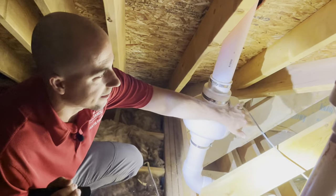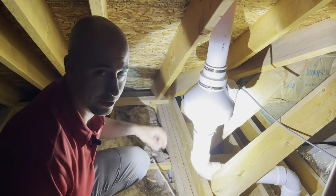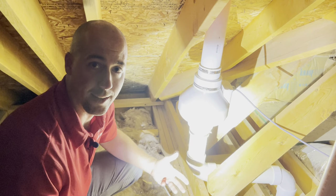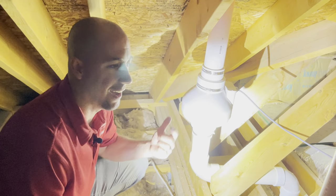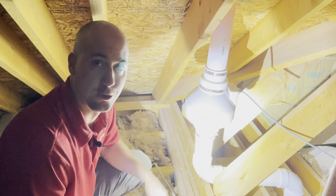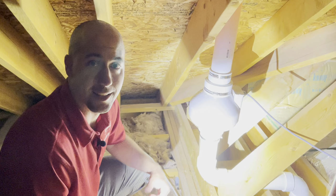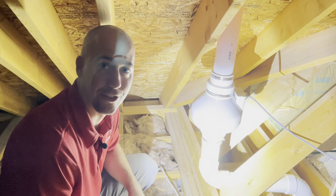Here we just have this tied over to an outlet that was installed with the house, that we plug it into — and that's how it's run from. We would install this and then seal the openings. If you have a basement, openings down there such as the sump crock opening we put a cover on, any excessive cracks, if there's a crawl space ceiling — those kinds of things. So that's what goes into going from a passive system to what's known as an active radon mitigation system.